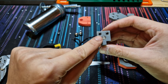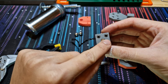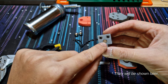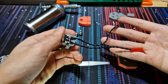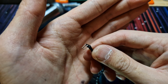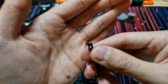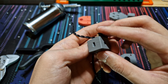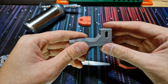The second piece is less straightforward. It has two 3mm sleeve bearings — the same sleeve bearings found on the Mischanger itself — pressed into place. Down here there's a magnet to attract to the other piece that will be bolted to the back of the bed. On the back is a microswitch wired up to a two-pin connector for quick disassembly. On the other end is a pair of angled 2.54mm Dupont pins. On top there's a slot for an M3 nut to be pushed in, with a hole for the bolt to go through.